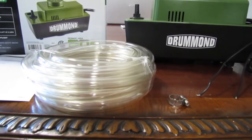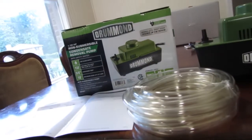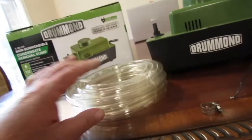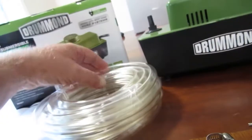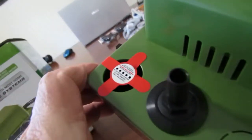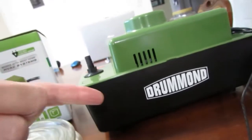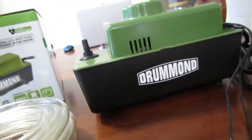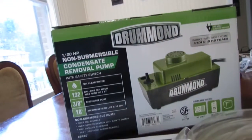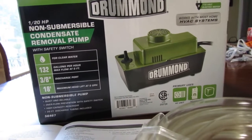That's a lot of water. I'm going to show you something here in a little bit in the same video. I got this from Harbor Freight — this is a Drummond model. It came with this hose and a clamp, and this is a discharge hose so it will actually go on this barbed fitting there. It's got a little warning not to run this more than 10 seconds because it'll burn up the pump. Basically, you need to put water in this before you turn it on to keep it from running dry. This is what the box looks like — I got this over the weekend in one of their sales and just happened to time it just right.